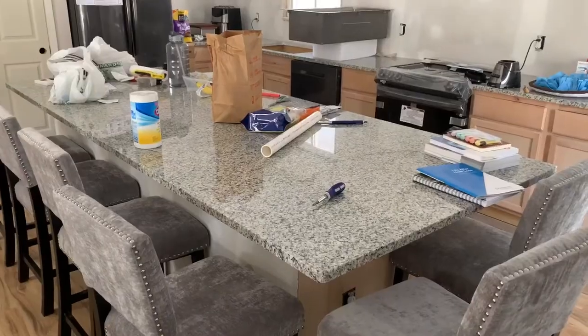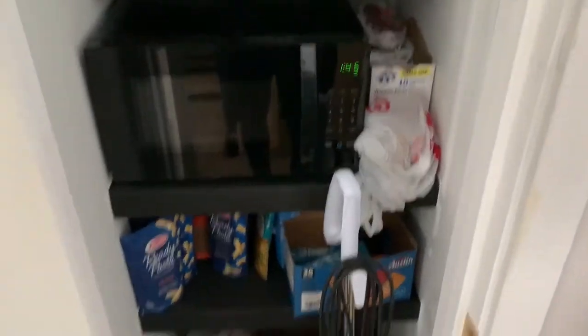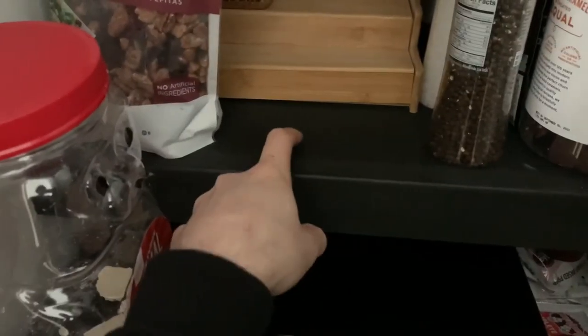Back to the kitchen pantry — I built this in such a way that I used two-by-twos. I got a two-by-four and split it in half and used that as the frame. Then I put a piece of plywood on top of it to give it structure as far as the shelf goes. Over that I did the same luan that I put on the cabinets down low, just to finish off the sides. And on the front I did a piece of trim. Essentially it's got two different pieces where the luan meets the trim.